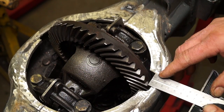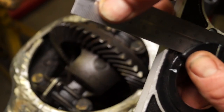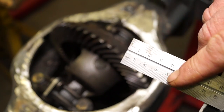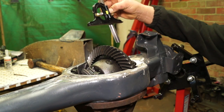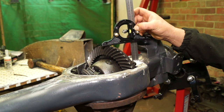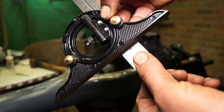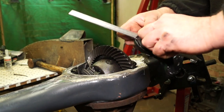These are the gaps I showed you in the video. From the crown wheel — or the highest point of the crown wheel — to the edge is about 11 millimetres. Don't ask me what that is in Imperial or American measurements because I really don't know. This steel rule is good enough at 20 degrees centigrade; we don't have to be that accurate. I've used it as a rough height guide, measuring at a 90-degree angle, and I can see here it's measuring out about 70 millimetres from the casing to the top of the crown wheel.